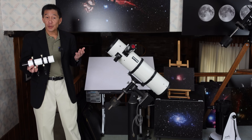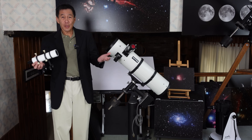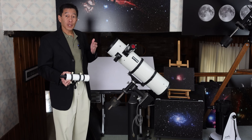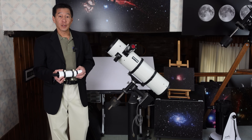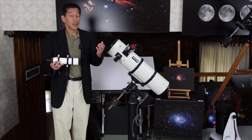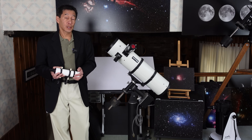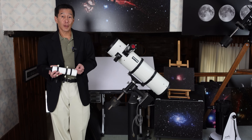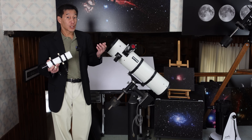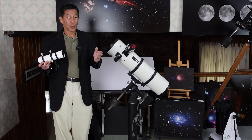You may be asking how the mirror looks. The optics on this are outstanding. A 6-inch F5 mirror today — we're used to fast Newtonians — but back in the early 1980s this was a bit of a novelty. Most reflectors were long and skinny. It was advertised as a wide-field telescope. The faster the mirror, the harder it is to make a good figure on it, and as you go from F8 to F6, F5, things get very difficult — aberrations, especially coma near the edge of the field. I saw almost none of that here, very remarkable.